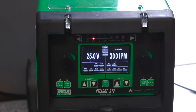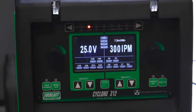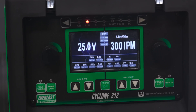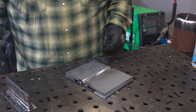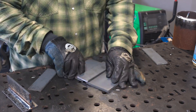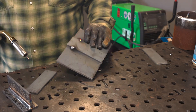The settings we found to run really good on this wire were 25 volts and 300 wire speed. I don't typically like running that low in a flat or horizontal position, but we're going to give it a try on this coupon. Usually you need to be up a little bit higher, but this machine seems to be putting out a pretty good amount of power at this setting. I'm going to start off right there at 25 and 300, and if I need to adjust because of the added mass of the three-eighths plate, we may turn it up.